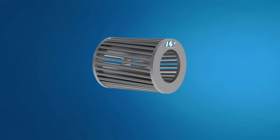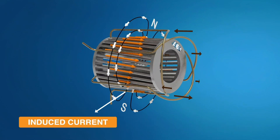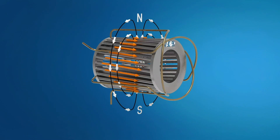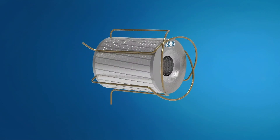This same phenomenon happens inside the induction motor, with the only difference that the loop is replaced by a squirrel cage rotor. The three-phase alternating current passing through the stator produces a rotating magnetic field. This is why the engine is called an induction motor — electricity is induced on the rotor by electromagnetic induction and not by direct electrical connection. To facilitate this electromagnetic induction phenomenon, layers of iron sheets are enclosed within the rotor. These thin ferromagnetic material layers favor the magnetic induction and minimize the eddy currents.